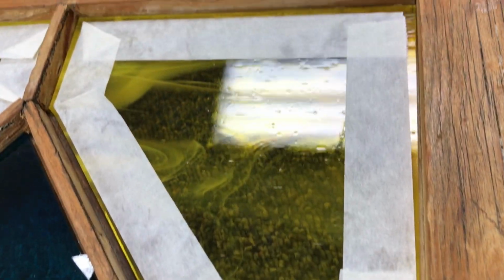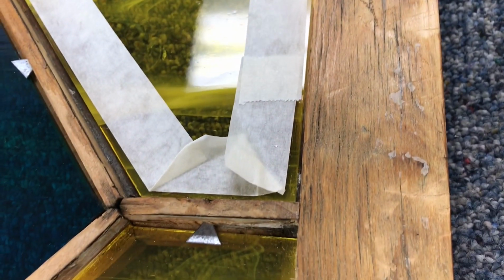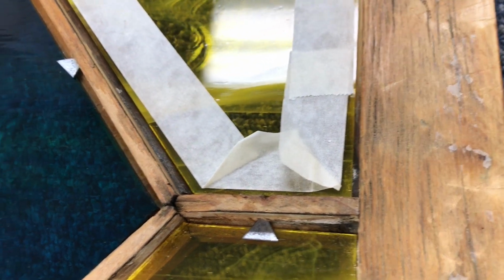In this case here, we've decided to go with the silicone seal, because the glass we're replacing the mirror with is transparent. And unlike the mirror, which has an opaque backing, this you can actually see through, which means that you're going to be able to see the spikes at an angle from the front side, and that is not appealing. A nice clean silicone bead hidden in the routed edge is a much cleaner finish. So in this case, silicone wins.